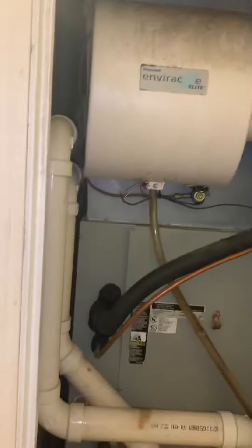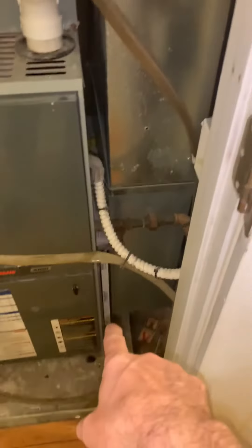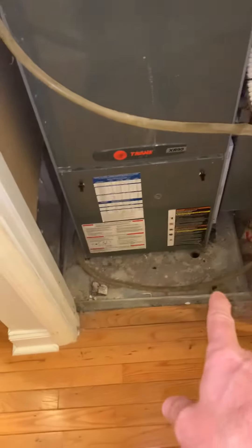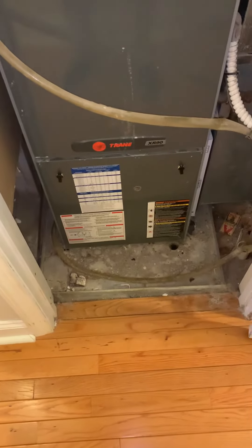We do have a good valve for shutoff. Probably get into power vent style. And then return — this will remain the same. However, we want to increase the filter size. They're 20 by 25 by 1. Put on a return air face to get better airflow coming back to the unit.